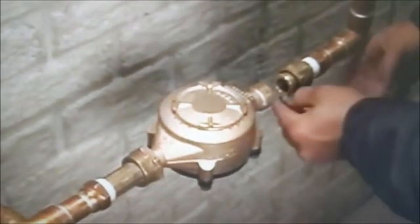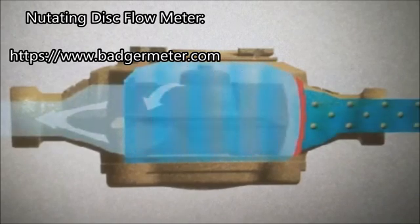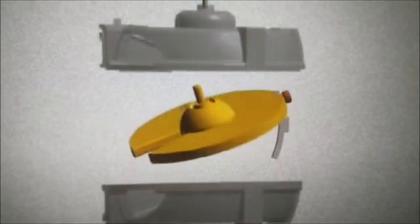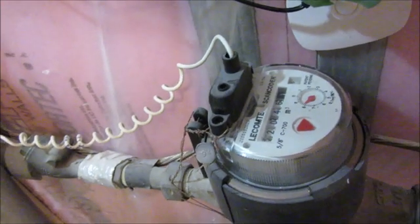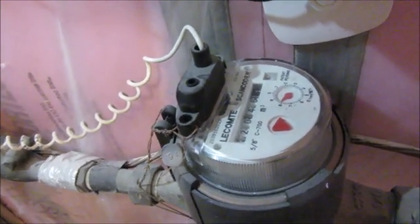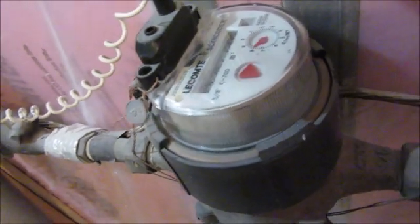This is a video from Badger Meter. They make various water meters and other devices for public utilities. I'll put a link in the description so you can get more detail. This shows the nutating disc type of water meter. The mechanical part is intrusive — you have to install it on the pipe — but once installed, you just snap a meter on the top. The mechanical ones are cool because they don't seem to need any electricity to run the meter, and when someone comes to read it they just tap a reader on the end and pick up the recent water flow history.